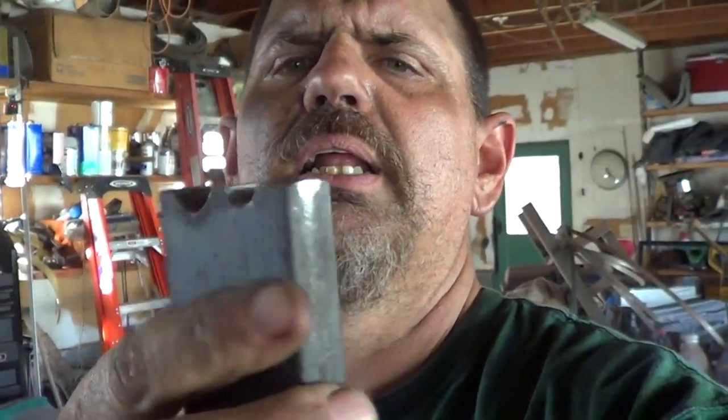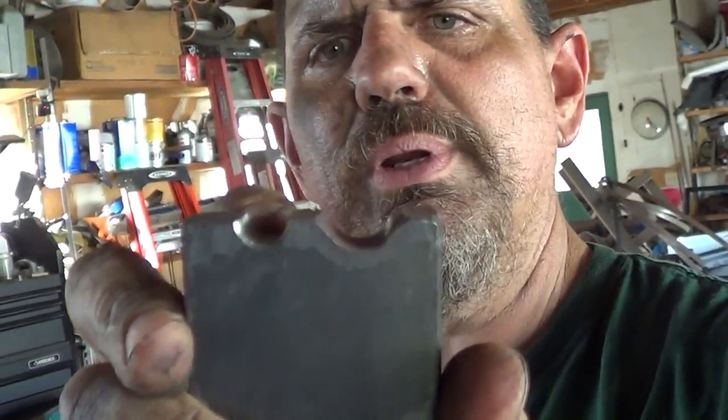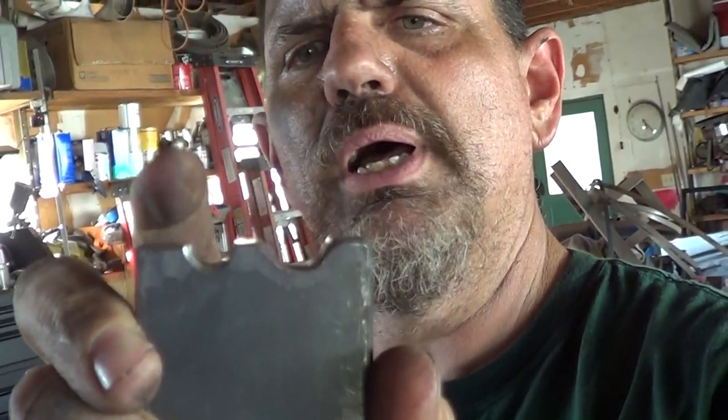using this little guy right here, these edges were sharp. You can see on the 3/8, I haven't softened it yet, but I softened the one on the 1/2 inch, and the thing was, it was putting bite marks in the tenon. Those are great. I'm absolutely excited and thrilled. They will clean up. I will clean them up a little bit more, and tomorrow afternoon maybe I'll be able to forge the handle and get those drilled and set these in the handle.